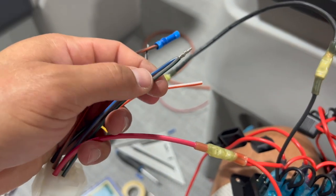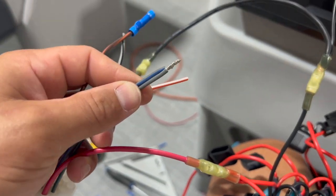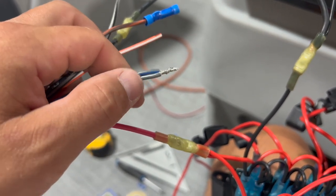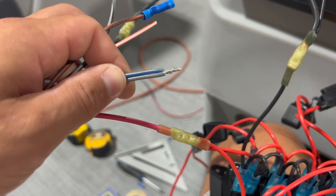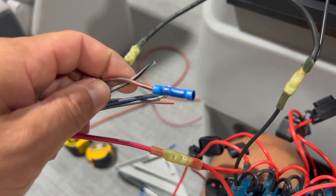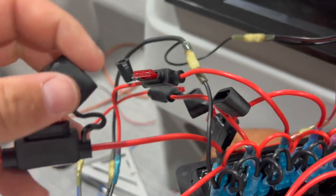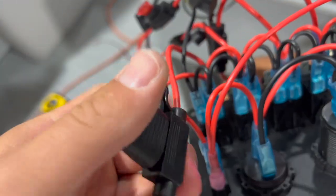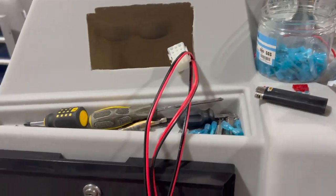The big notable here is that gray with green and gray with blue — I'm bringing those together and they'll both splice into the navigation light switch. If the switch had push-forward for all lights and back for just the anchor light, that would be different. But we're putting these all together — on and off for all of our lights, stern and front. Orange will go to our horn, gray with black is going to go to docking lights. Fuses in, all we've got to do is put that little lid on — it snaps into place and that's going to protect it from the elements.